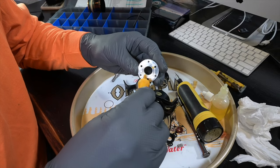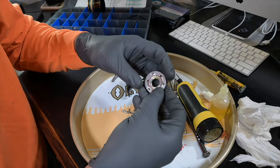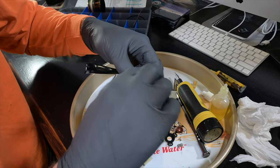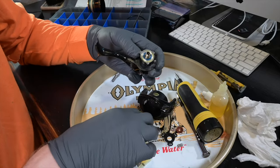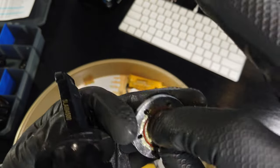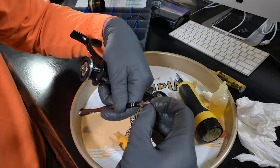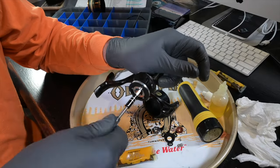Grease up the body retaining plate and the body head seal will fit on nicely and stick to it — there's a little wall that the seal goes around. Grease up the ball bearing inside its collar to help keep the seal, and put a little oil on the pinion gear itself where it meets the ball bearing. Put the rotor brake and retainer plate down, line up the holes, and tighten all of the rotor brake slash retaining plate screws. Tighten it up but don't strip it.